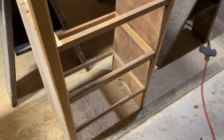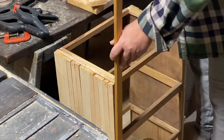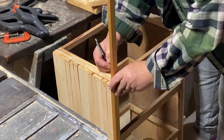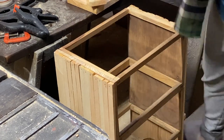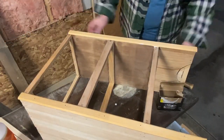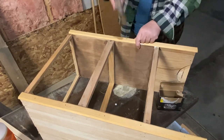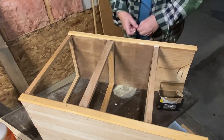I have a couple of end pieces that I want to put on to kind of finish off the front. These came from the dump — I got two pieces of trim, I think they were five feet long, and I wanted to use them to finish this off. I just measured it out, made a mark of how tall I wanted it, and I'll make two exactly the same. I'm going to glue these down and then nail them in so they'll stay, and that'll make the front look really nice.